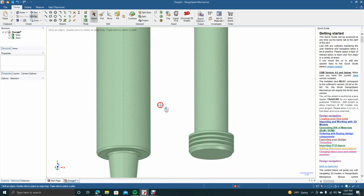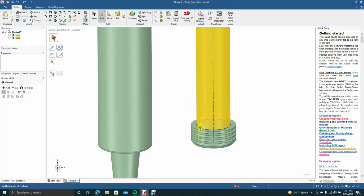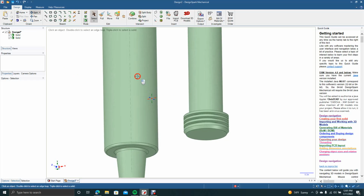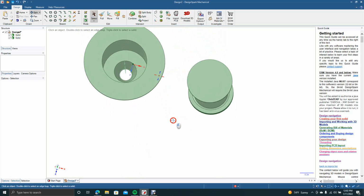Let's pan up. Not sure I'm going to do anything with those fins. Those fins you probably have to print with rubber, just so they're kind of flexible. But we will put a fillet here, 0.04. Some printers allow you to print this piece with plastic and then specify this stuff with rubber if you have one of those printers. That's really the only thing I'm going to do. I was going to put a radius around these, but I'm going to leave them straight because they would be better in here for the suction.